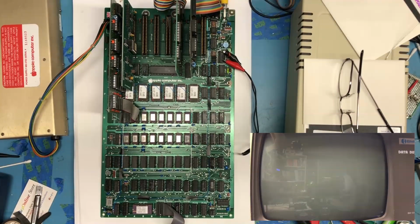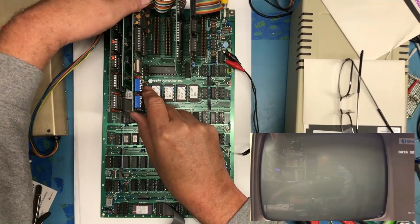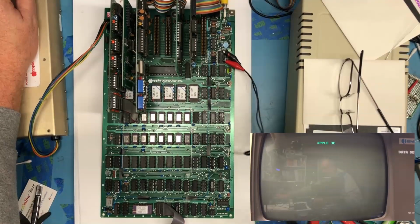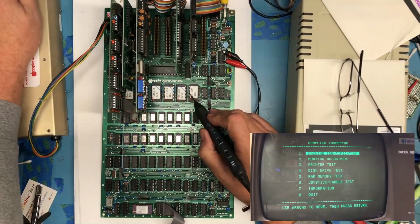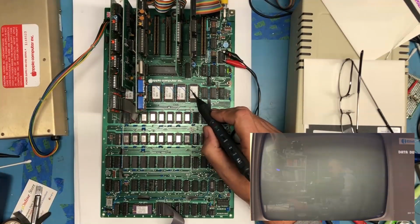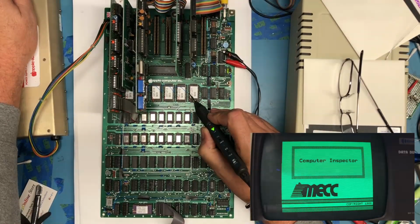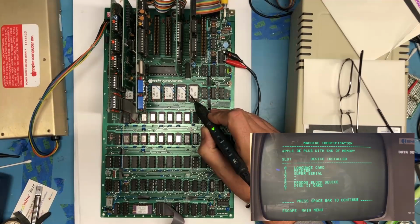We should have a super serial card floating around. Nice super serial card. We'll drop that in this slot. Actually, excuse me, got to finish booting here. Just because I like watching it. Excuse me. I need a cough button. Just because I like seeing the activity on it. The entire time it was accessing the floppy, that inhibit line was high and these EPROMs were disabled. We're now seeing the super serial card. That's an excellent sign.